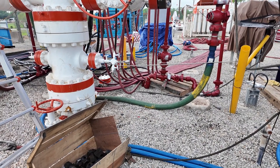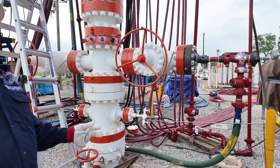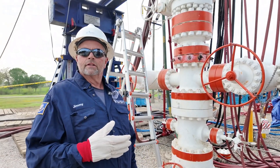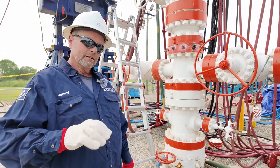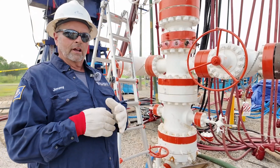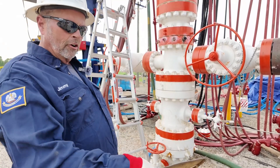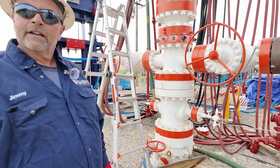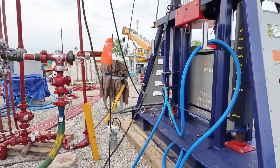Your preload gauge — we've got two sensors and a gauge. We've got an actual pressure gauge and it's a 200-to-one ratio. So we set our pressure at 300 pounds — that's all we're using at a 3,500 capacity. 300 pounds is all we need. Crank it up to 300, hold the levers back, let the hydraulics take care of it. I usually hold it back quite a bit to make sure any settlement in the ground — if you've got loose gravel or loose terrain — is taken care of. Or inclement weather — it'll stay overnight just to make sure.